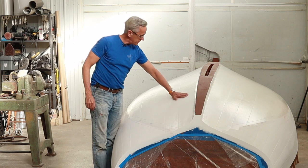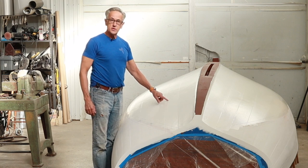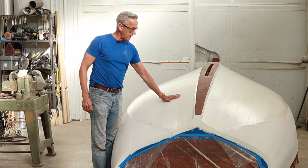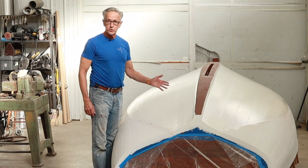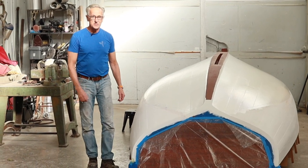The bottom coat is nice and dry. It's really a pretty fast drying paint. The spec sheet suggests 1 or 2 coats per season and an extra 1 or 2 coats on a new substrate. So I put 3 coats on at this time. Once I put the keel and the deadwood on and I do a little fairing in here, I'll probably add another one or two coats then. So I'm pretty excited now to see what this green is going to look like on here. So let's get that paint mixed up.